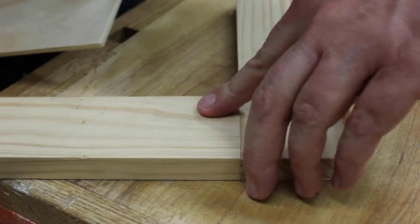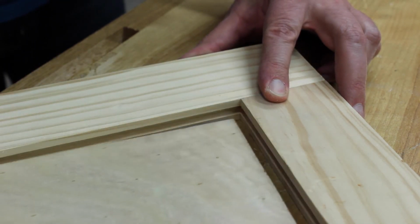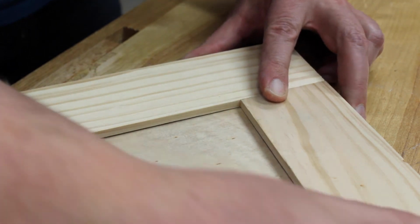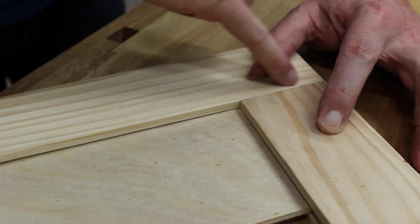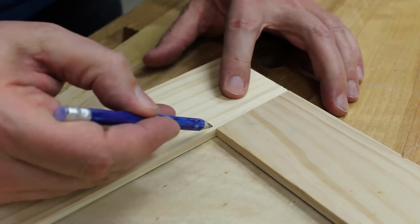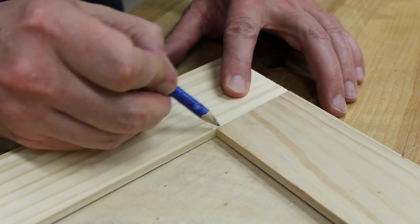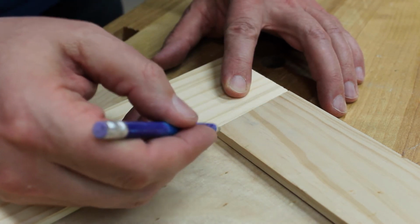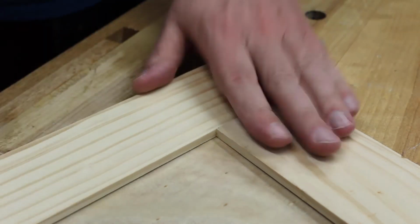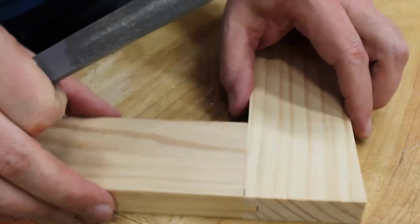And then here, if I spin this around, then this is where plywood will go right into that groove like that. So this is also the reason this fits so nicely and it's so tight, because we did cut it at a little bit of an angle going back this way, just a tiny little bit, so that it hits here first. And if there's any obstruction in there or a miscut or something, you still have a really nice joint right here.